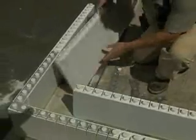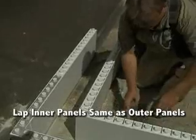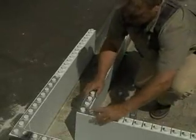Place these panels in the inside corner track, making sure that the ends line up with the outer panels. Always lap the inner panels the same as the outer panels. Place inner corner brackets over the knobs as shown.